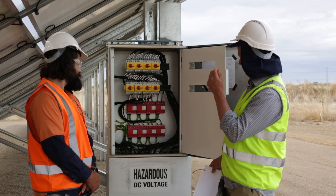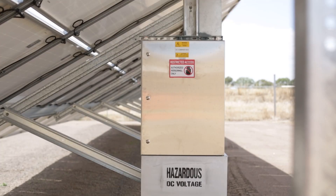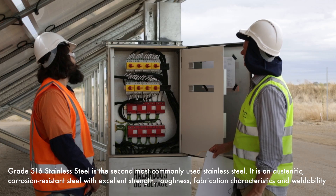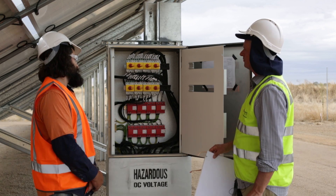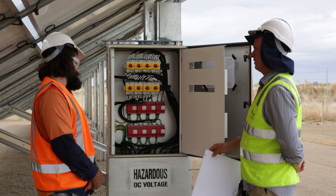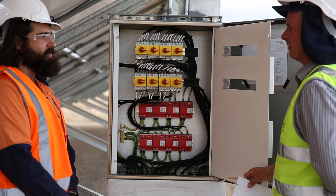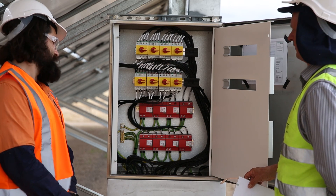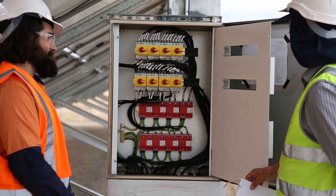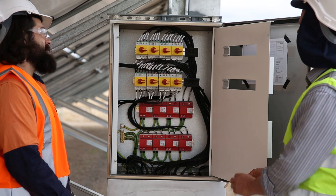This board looks like it's a stainless — I assume it's 316 stainless, marine grade? That's correct. It's also two millimetre stainless steel, which is a little bit higher grade than the standard stainless steel switchboards. It was a slight requirement to have at least two millimetres. Normally it's 1.6mm, so we had to have this one made a little bit bigger.